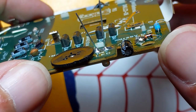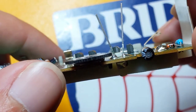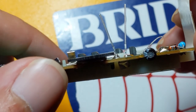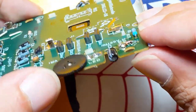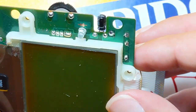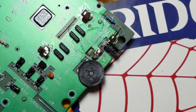That should work perfectly. I'm going to go ahead and trim those up, being mindful of board clearance below the contrast knob — make sure that your solder fillet doesn't get in the way. Everything looks good. Now we're just going to clean up all that flux with some alcohol, and we can reassemble this bad boy and see what we got.